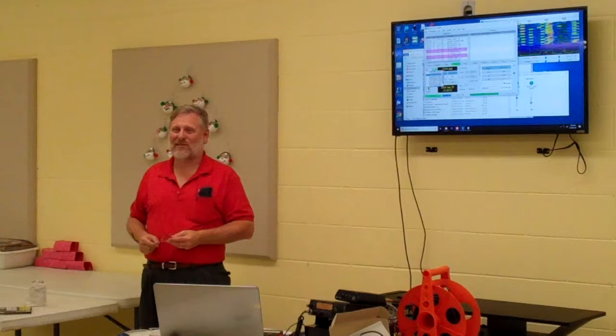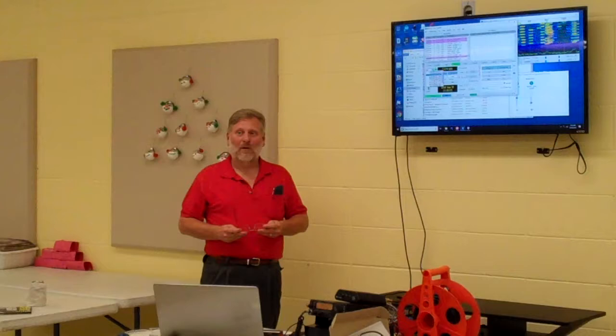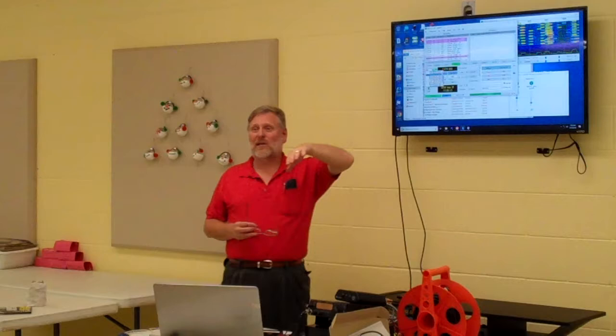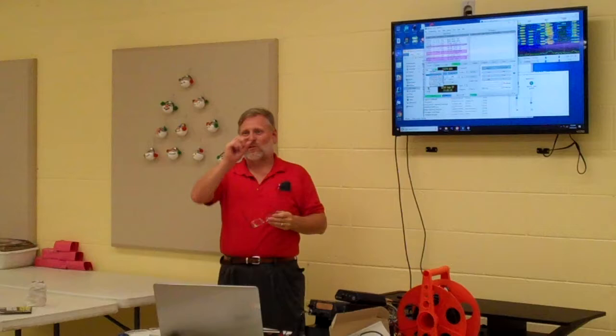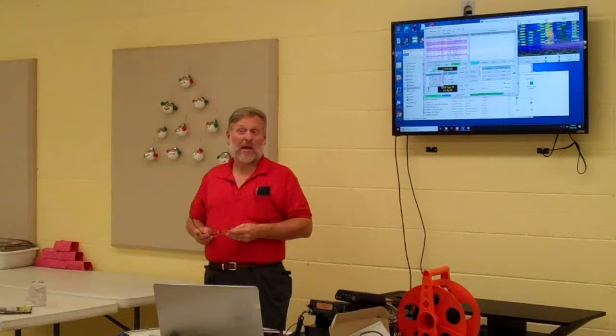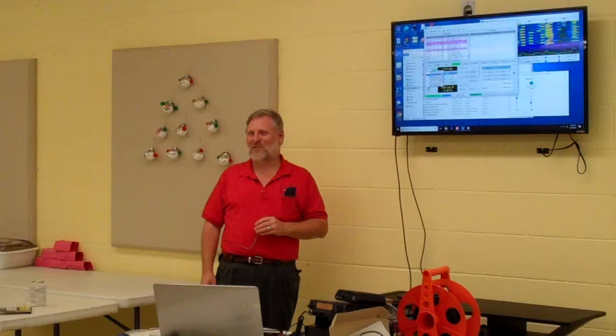What happens if you get 2 or 3 people trying to call at the same time? Only one will latch on. And that happens to me a lot. I'll answer a CQ back, and it'll just disable. This will go red when you're transmitting. It'll disable that, and you'll see in the log that he made a contact with another person. The only exception to that is if you go into DXpedition mode, then you can do multiple at the same time. I have not tried that. I have not been bold enough to try to answer 2 or 3 people back at the same time.